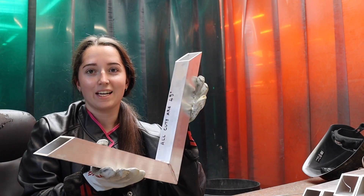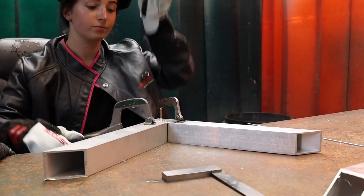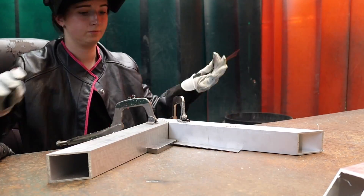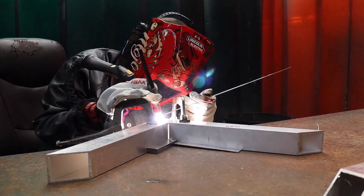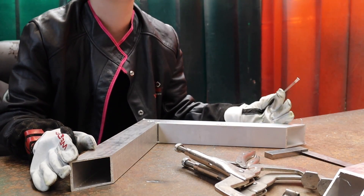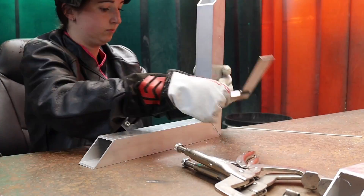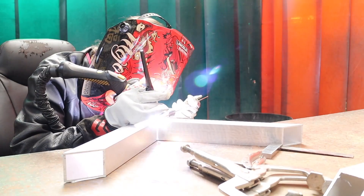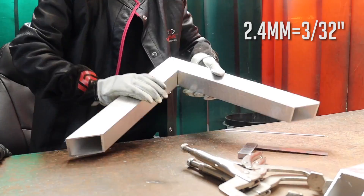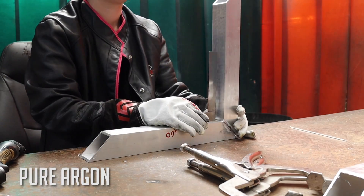With the 12 Part A's I'm going to create six of these. Sometimes you may need to whack it with a hammer to get it square. I'm making my infinity cube out of aluminium, using a TIG machine on an AC setting with a 2.4 zirconiated white tip tungsten and a 2.4 aluminium silicon 4043 filler rod. I'm using pure argon shielding gas.